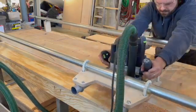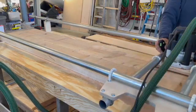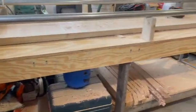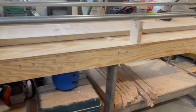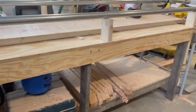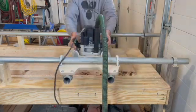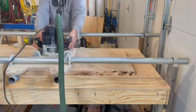The other thing I learned is that in this particular scenario the slab I'm milling is kind of at the max capacity of the dimensions I built. So when I went in to plunge with my router, the deflection would also reflect in the wood and I got a bunch of swirl marks deeper than where the router was actually flattening. In the future I would have probably built this a little wider so that I could fully plunge the router down and then push it into the slab.